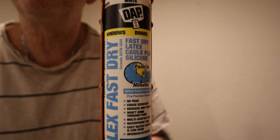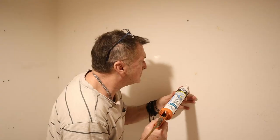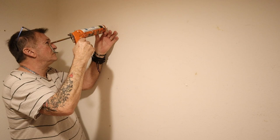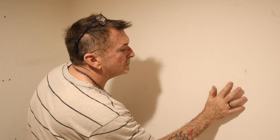You're really going to be happy with me because I'm going to show you — even though I am a drywall guy and I've done it for years — if you just have this hole, you don't even have to get your knife or plaster out. You fill those holes with a quick dry caulk like this Alex Plus. Take your finger and pull away from the hole each different way, dabbing it carefully. For the most part it will not shrink bad, but if you do have one or two that shrink, put on a little more.